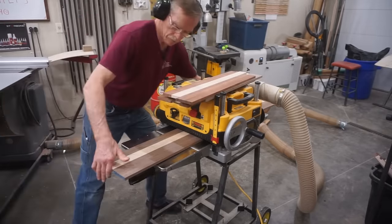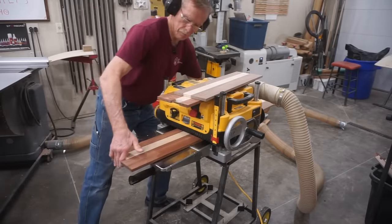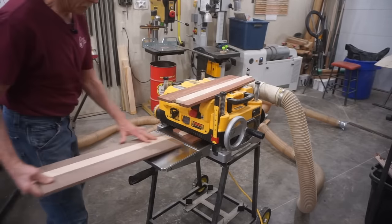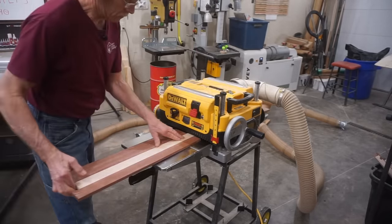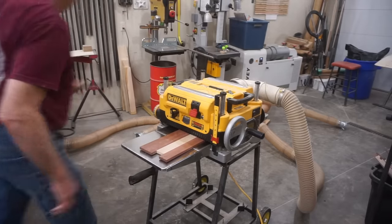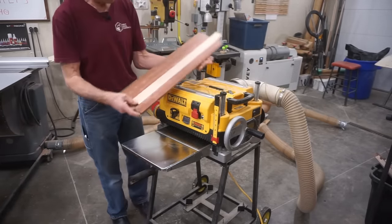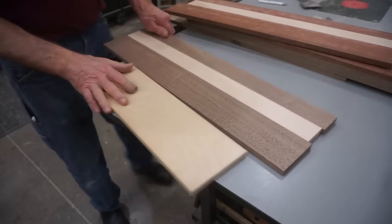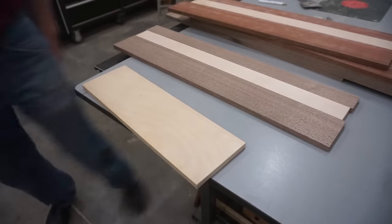If you're impressed by the performance of this machine on this kind of an operation, keep in mind that I keep this machine well fed and well cared for by waxing the platen and making sure all the bearings and rollers are in tip-top shape, because I both expect and need peak performance out of the machine on a project like this. And that really is all it takes to get a perfect match for thickness between the solid wood sides and the plywood ends on these tool totes.